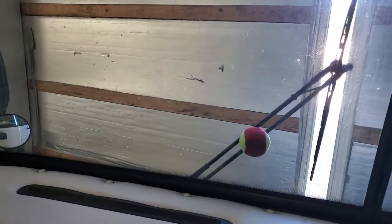I'll tell you what I've learned in the past: you check power and grounds to every module first before you get into all your troubleshooting. So before I get into all the troubleshooting, guess what we do - check power and grounds. I'm going to show you right here. Got it real nice.